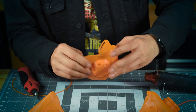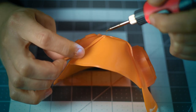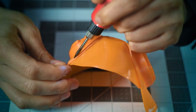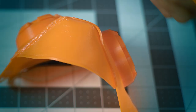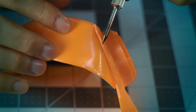Once the mask has been properly fitted to the user's face, you'll find some pretty large gaps where the panels have been folded and tucked, mainly in the chin and nose areas. What we found works best is to run a raw piece of filament of the same material along the gap and weld the seam shut using a small soldering iron.